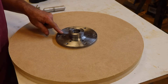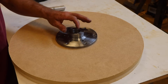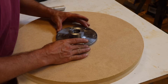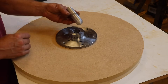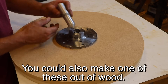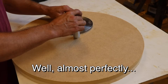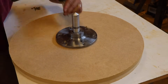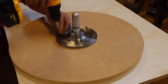So I need a faceplate. I made this in a previous video - certainly not necessary to make your own, you can buy them quite cheaply. They're going to be different for different lathes; my lathe is an inch and a quarter, eight threads per inch. How do you line up the faceplate perfectly with a center you've already drilled? You can eyeball it and get it pretty close, but I melted down aluminum cans into stock and turned a piece so it fits perfectly into my faceplate with a center on it, helping me get the faceplate exactly centered. I don't screw them all the way down right away - if I put them all in partway it averages out.